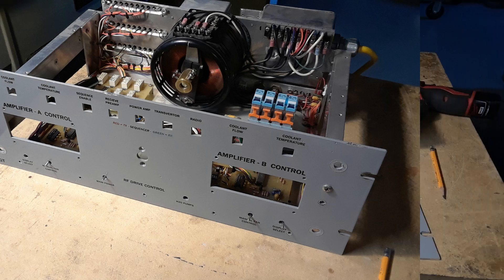I needed to build some kind of mounting bezel for the two 5-inch displays. I took some eighth-inch aluminum and cut out a square frame, carefully filed the angles and slopes to make it look sort of pretty, then flipped it over and cemented on four small bolts that the circuit boards of the display will bolt to from the back of the mounting bezels. Some fine sanding, a little bit of spray paint, and they turned out pretty nice. The displays fit right onto them perfectly and the four holes mount them to the front panel.